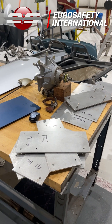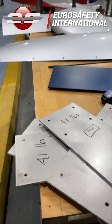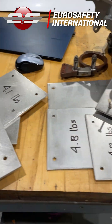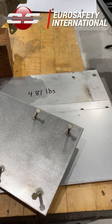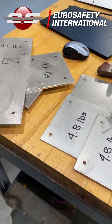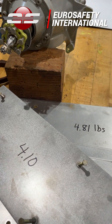Here are the ballast weights on the EC-120 for this particular aircraft. What we've done is written the weight of each individual plate, because we found that when you're looking at them on the aircraft and you don't know what you've got and you can't find the right records, sometimes — especially in a pre-purchase inspection — you want to know how much ballast weight is actually on the back.